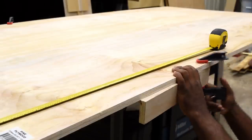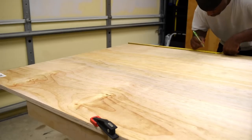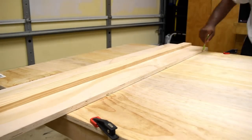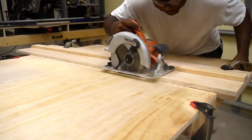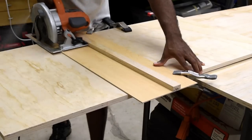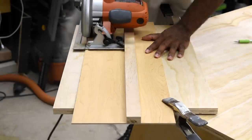I'm going to start by cutting the top first. I placed a piece of scrap wood right below the location which I plan to cut, and this should help support the wood after it's cut. I'm going to use this circular saw jig which I made in a previous build. After the jig is clamped in place, I can then take the circular saw and make the first cut. This is just a smaller version of the same jig that I used to cut the wood down to the right size.